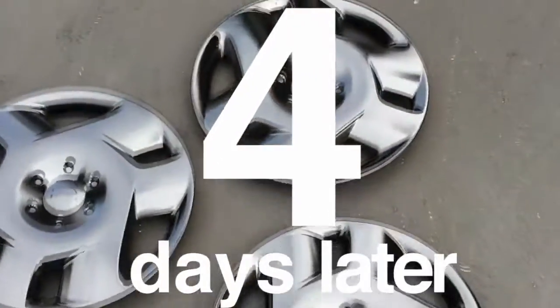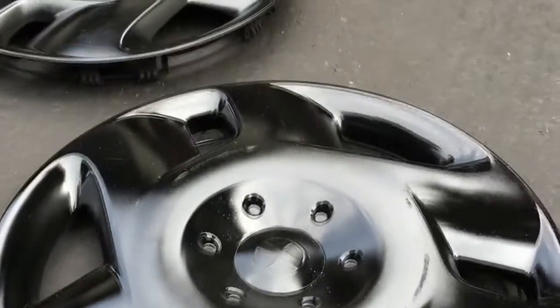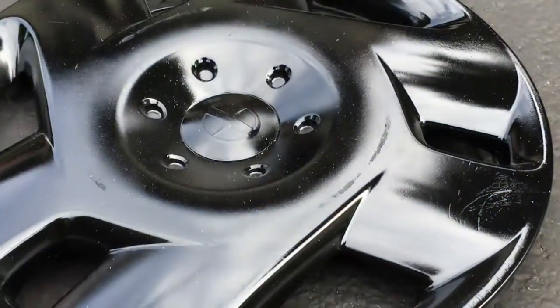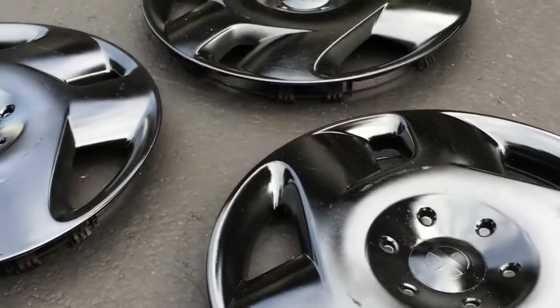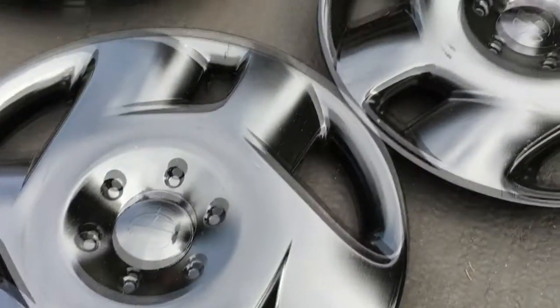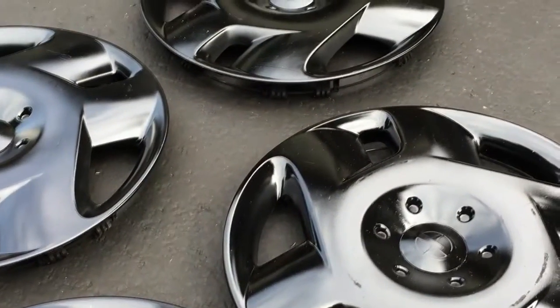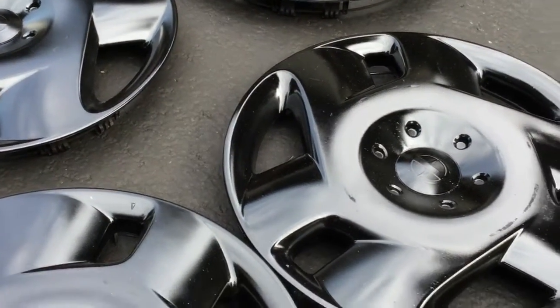Here's what they look like all painted now. Letting them dry is good, but you need to let them cure. If a member of your household stacks one on top of another, you will get problem areas where the paint actually sticks and comes off — and that's a pretty big problem. When you paint them, put them somewhere out of the way, away from children and the elements, for at least a couple of days. This is four days later and they should be cured — going ahead to wet sand.